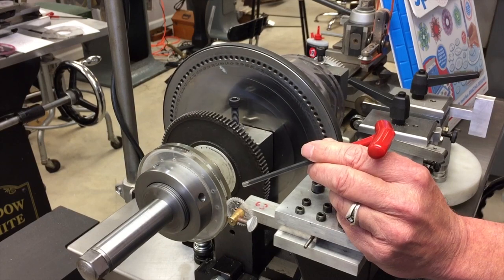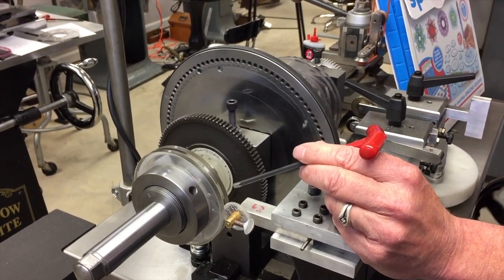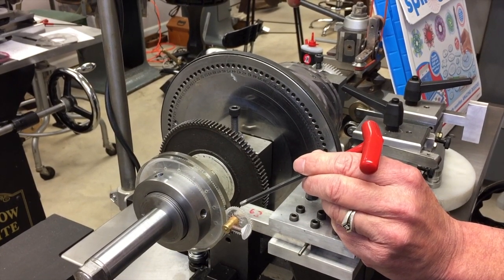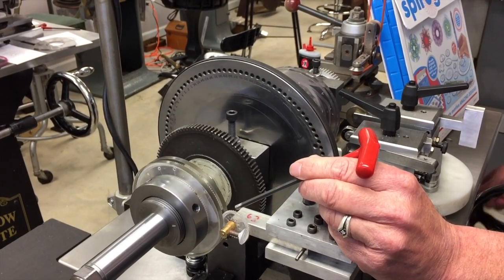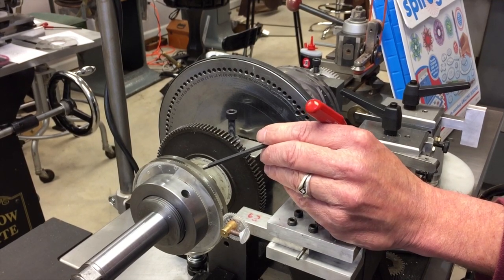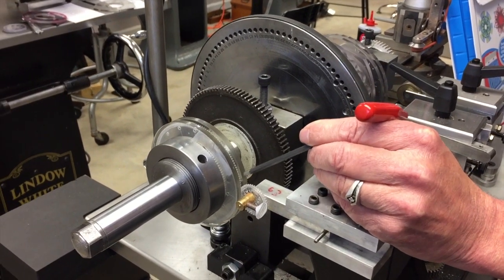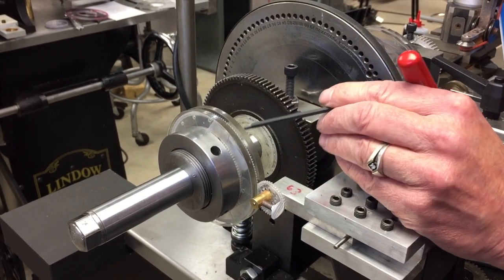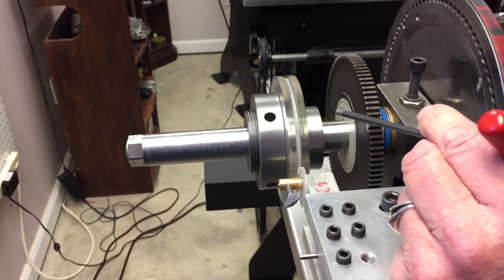You get no ski jumping, and you get hundreds and hundreds of combinations of rosettes just using different gears that are in that spirograph kit, which only cost about $26. All this is the large spirograph gear sandwiched between two pieces of plexiglass, so this small gear won't override left or right. And I made a small sheet metal bushing with a 1-inch hole holding the large gear. So that's how this idea first started.